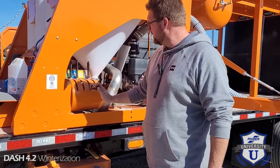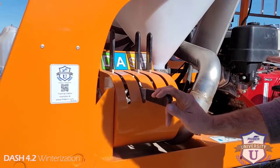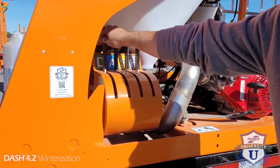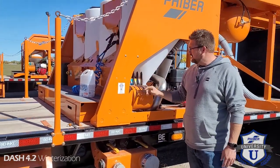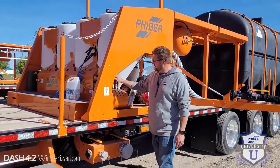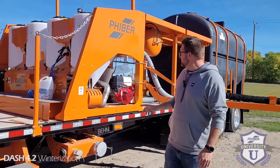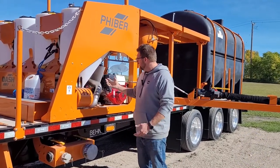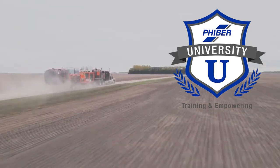We'll do S, then A, and now the last one we're going to do is D. Now we've run out of antifreeze, but it should have stuff that's pushing through. You can hear the rinse pump sucking through and that should be done. The last thing we want to do now is, because we've drained the motor in the pump, always leave your master water on. And that should be it.